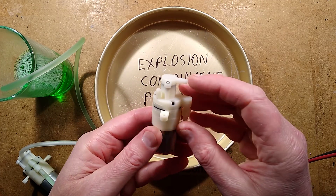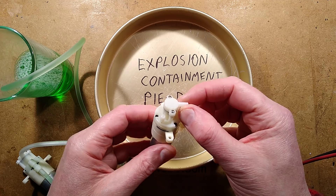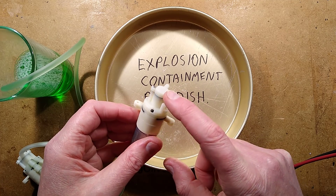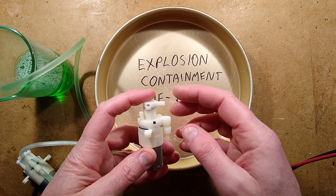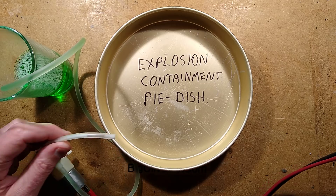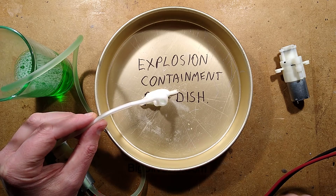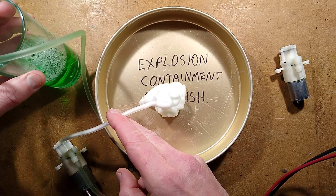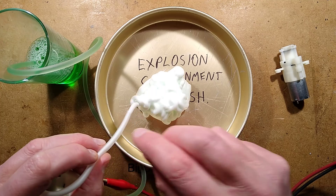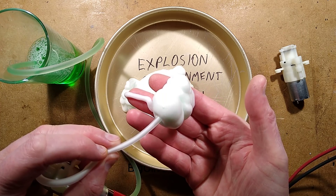This is a low voltage DC motor driven pump. It has a liquid intake, an air intake, and it combines the two to produce a foam. This one appears to have the mesh on the output built in, because the other ones that just combine them straight together produce quite coarse bubbly output. The power supply is on, it's sucking the liquid from a glass with washing up liquid and water in it, and it's producing a fairly thick, very light fluffy foam — quite nice.